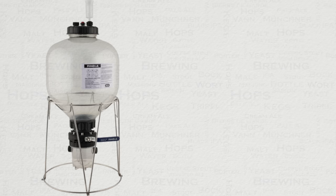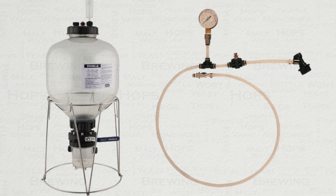Furthermore, if you find yourself needing to move a plastic pressure vessel, then I also recommend that you release the pressure first. This will protect the product in case of accidents, knocks and bumps. Should you damage a plastic pressure vessel, then I highly recommend that you perform a hydro pressure test to be sure that the vessel is still up to the task. Hydro testing is suggested by some manufacturers to be performed once every two years, and kits are available for sale to make this easy.